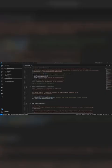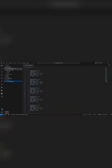The add to transaction method ensures that the data has been received from the JSON file, essentially from the cloud, and it ensures that the proof of work algorithm is satisfied, because only then would the block be allowed to be appended and a success message printed for that particular block. Finally, we have our string method that cycles through the entire blockchain to print out every single block at the end with their hash IDs, the timestamps, and the block data itself. This is the JSON format.